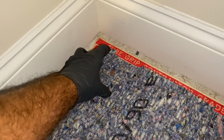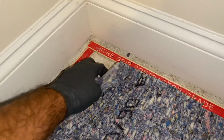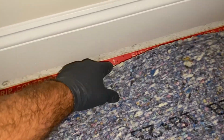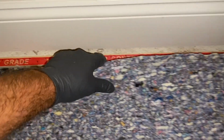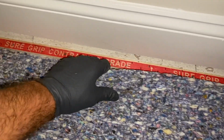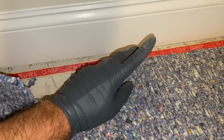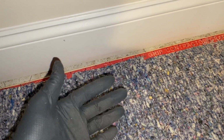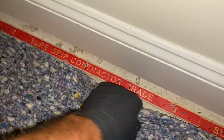All right, we got all the rug removed, exposing all of the underlayment layer. So the underlayment layer is stapled into this wooden subfloor. And carefully starting in a corner, we're gonna pry it off of the staples. The staples typically run along the whole edge of the tack stripping, as well as where the pieces of underlayment meet. And if you check out the top right-hand corner of your screen, you will find my entire 10-minute video of doing all the flooring upstairs.